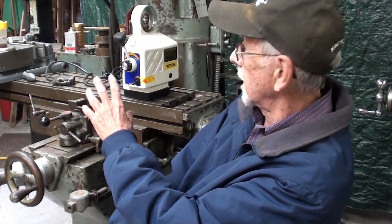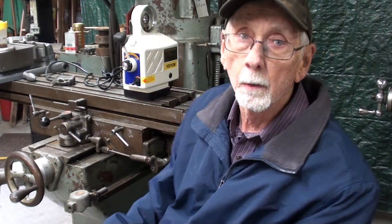Welcome back to beautiful Studio G. Today's video is all about comparing the more modern type of power longitudinal feed on milling machines, as opposed to the older styles used on this particular machine. Most heavier milling machines have their own power feed powered by their primary motor, but the South Bend is quite a bit different. I've shown some of that in the past, but let's take a look at how this power feed works, and also the power feed on the Clausing, compared to an infinitely variable power speed that can be mounted on virtually any mill.